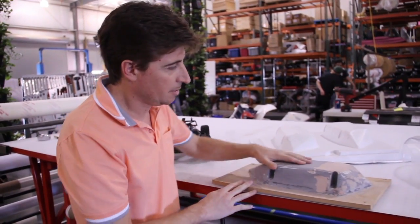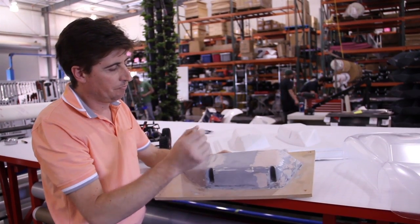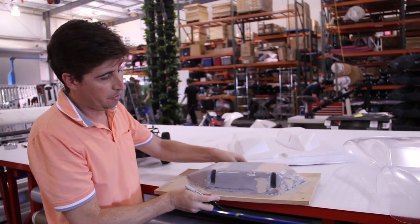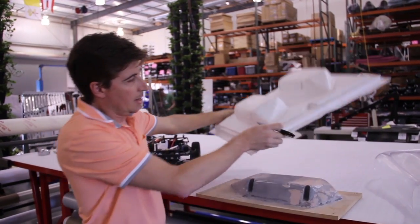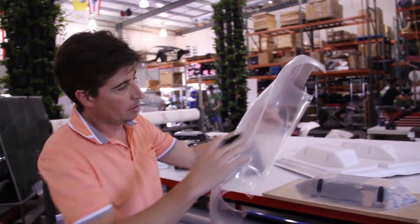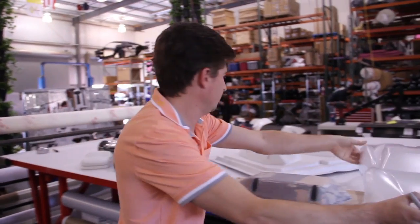I have here something that we were doing before for the cruiser. This is like a vacuum forming plug, where you can see this is the pull direction from the part, and this could be the part that comes from the process. A little different is going to be this one, because we have a negative part in the plastic, but this plastic is more flexible than this one.